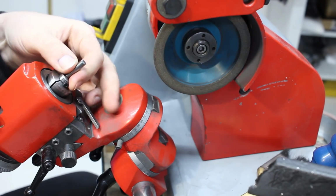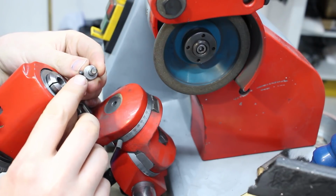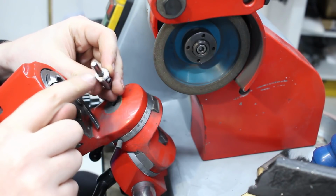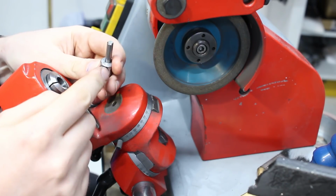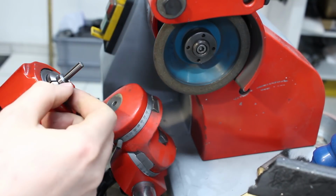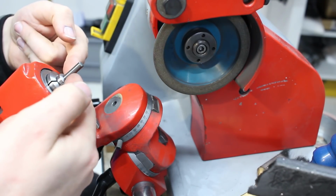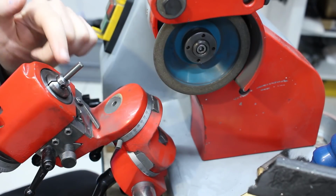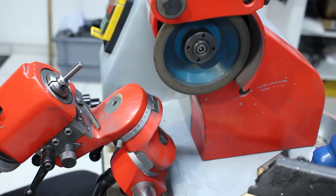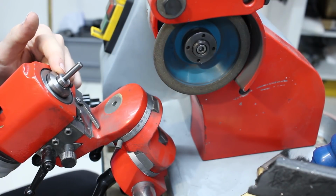I drop the bushing into the collet, and when you look full frontal onto the bushing, this screw indicates exactly opposed to the throw of the eccentric. So we can eyeball our orientation. In my case, I will just line the screw up to be in a horizontal plane with the piece. So the eccentric is oriented. And we set our indexing head to free spin, and now you can see that we have this eccentric motion.